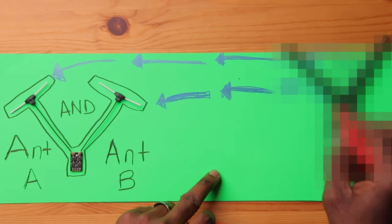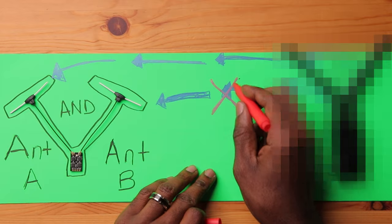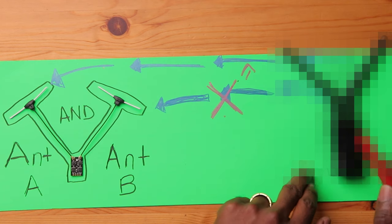Let's say you're flying in an environment with high interference — like Wi-Fi networks in a city or a race with multiple drones in the air. If packets on one antenna are blocked due to interference at that frequency, Gemini is simultaneously sending the same information on the other antenna at a different channel, usually about 40MHz apart. Most likely, those packets will make it through on the second antenna, giving you diversity on both your transmitter module and your receiver.